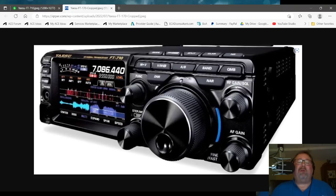When I'm in sideband mode, I want that to be RF gain. But look at this — AF gain, which is volume/audio frequency gain, was over here. Now it's at bottom right. On an FT-DX10, that is the manual notch filter adjustment, and the outer ring is for the audio peak filter and contour — whichever one you have enabled. The buttons are not here for those. Digital noise reduction on FT-DX10 is a button above volume — it's been moved up here, looks like a rubberized type button. There's also a button for narrow — to narrow your filter width below 500 Hz.